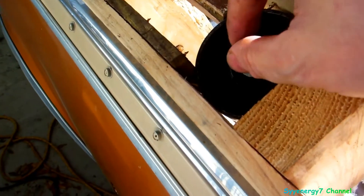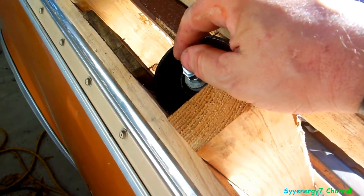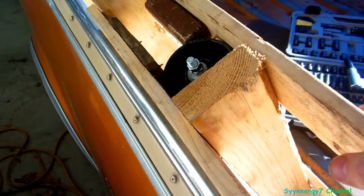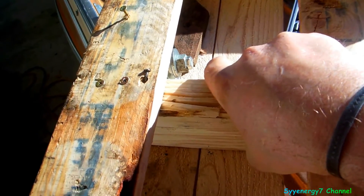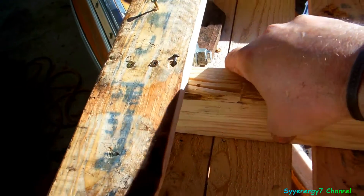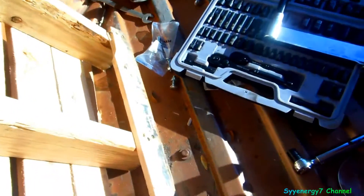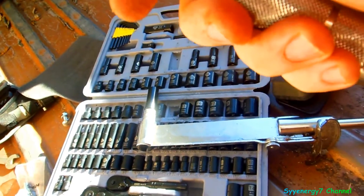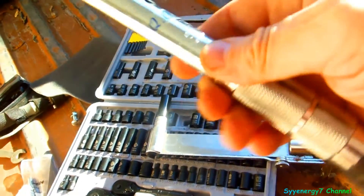What I did is I used this crate — actually this is what the gun safe came on — and I also had this part around: an actual idler pulley off a Chrysler Sebring. It's the old one, but it spins nice and easy with no resistance, just a bearing. What I've got going through it is a bolt on both sides — there's a 9/16 bolt on each side — and you just check one wrench against the other. For instance, set one to 240 inch-pounds (that's 20 foot-pounds) and the other should click at 240 inch-pounds.